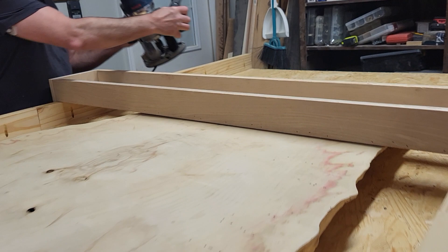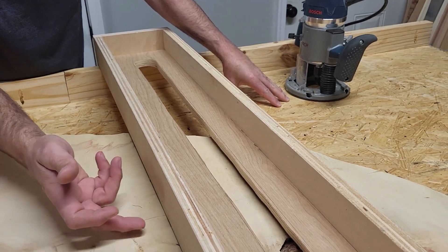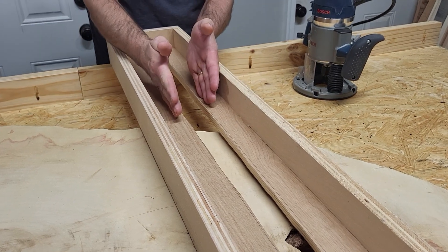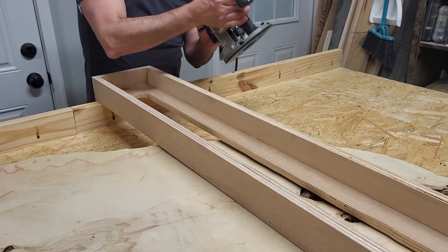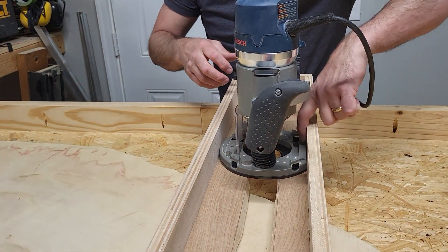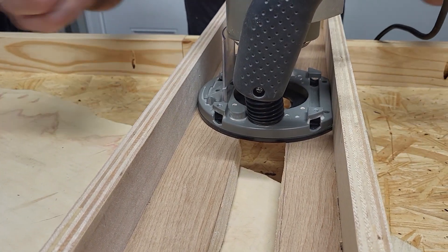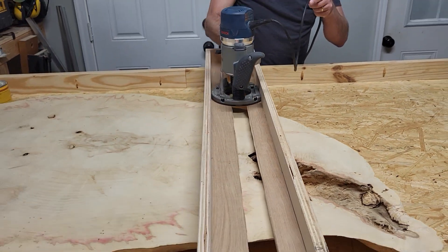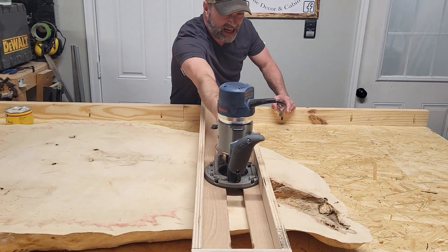Now, let me show you a couple of things about this jig. We made it out of three quarter inch plywood. As we built it, we just cut out with a hole saw on each end, put a level, cut the groove. That's where your bit's going to sit down in. And the width of it fits my router perfectly. You want the flat end right here against the wall. You don't want it on a circle because it'll dance around. And it's got just enough room to slide back and forth in here. It won't allow it to torque, to move, to jump the wall. And this slides real nice.